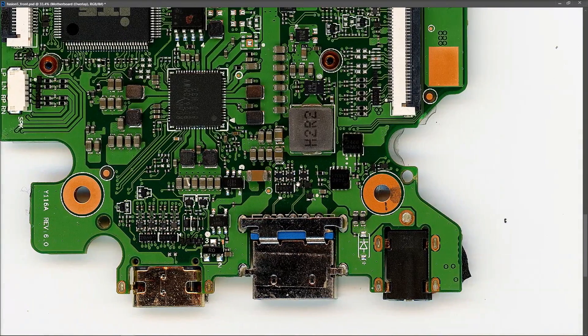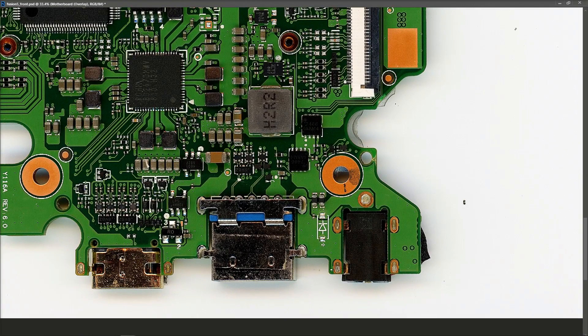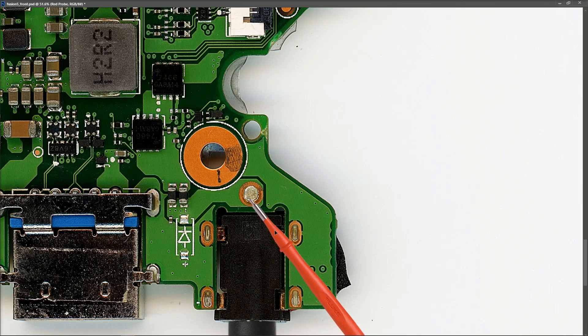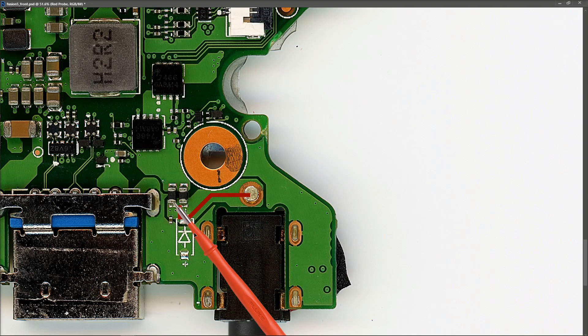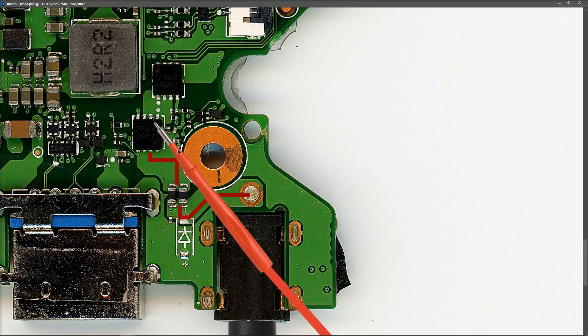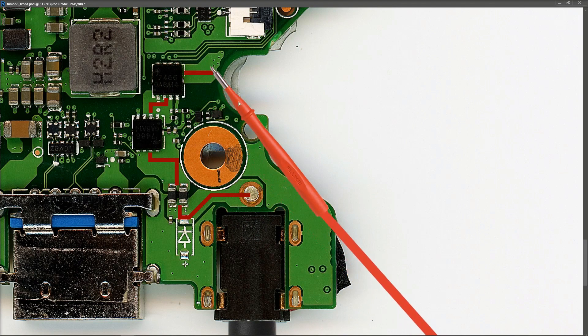The only thing I spotted was a small bit of dirt, but that's just dirt. What we're going to do is plug in our DC power adapter — 12 volts comes in through this little barrel jack here — and I'm going to follow that as it goes into our motherboard. It should come through these two inductors onto the drain pins of our first MOSFET, through to our second MOSFET, and then probably to a current sensor resistor somewhere else on the board.